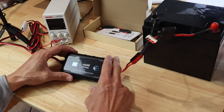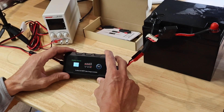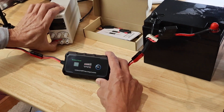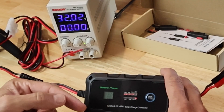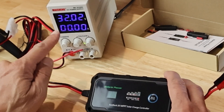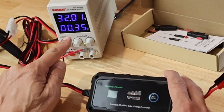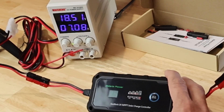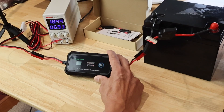Here's something else I really like that I just noticed about this solar charge controller: if you plug in your solar panel, there's really a soft start. Right now there's zero amps drawing, and it gradually ramps up the charging current, which is good.